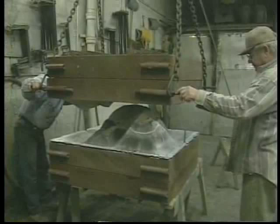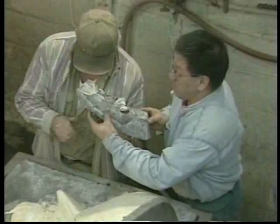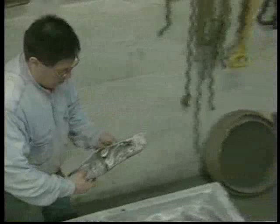Once that half is finished, the drag is lifted off. The exposed sections of the piece molds left against the model are then carefully removed and reassembled in their corresponding positions in the drag. Once the piece molds are repositioned, the plaster model can be removed and the outer mold is complete.